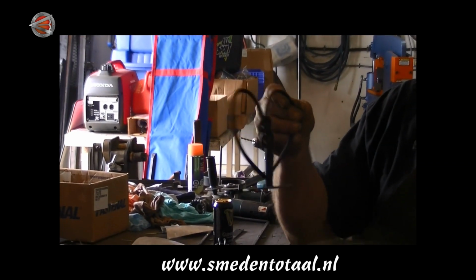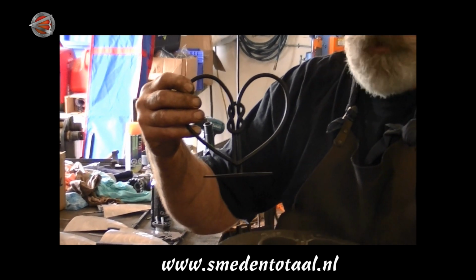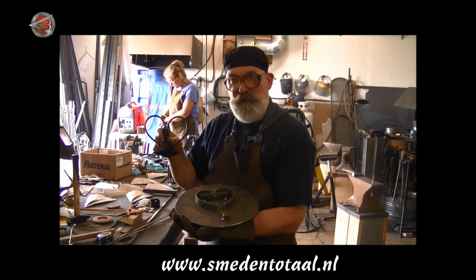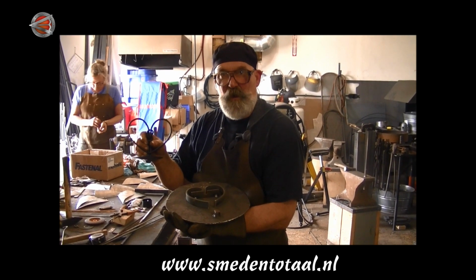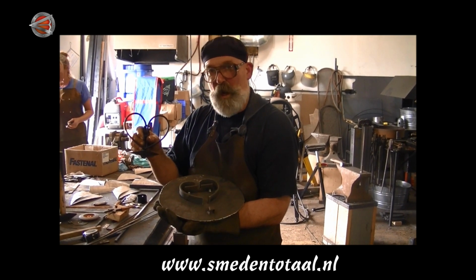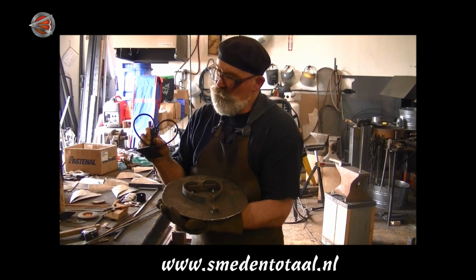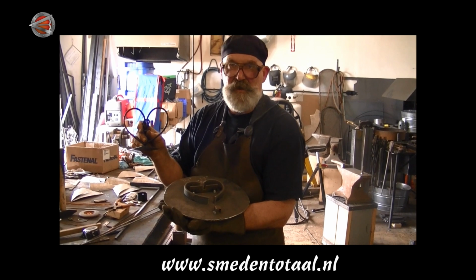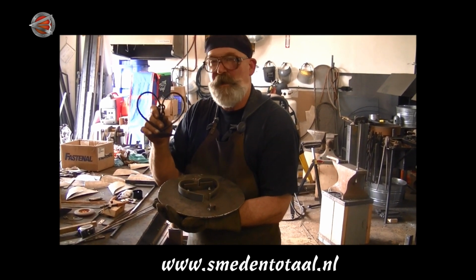Once they're crossed, if you wind up with one side a little bit long, you nip it off and you weld them together. These 2 ends can be welded together in the forge, but you need to slide a sheet of copper under there and you hammer them together. I like to use a piece of copper bar, which is like 2 inches wide and 1/4 inch thick, and then you can forge weld by taking this and lapping the ends of it. So one side, you lap out one way, the other side, just like doing the wagon.